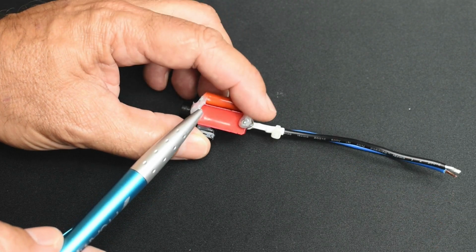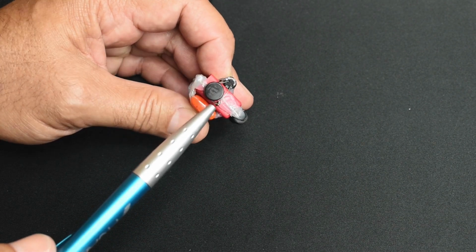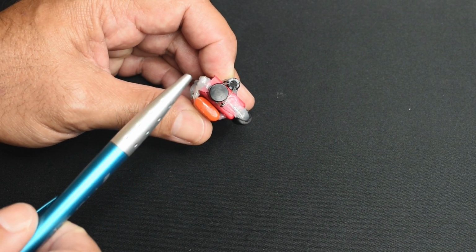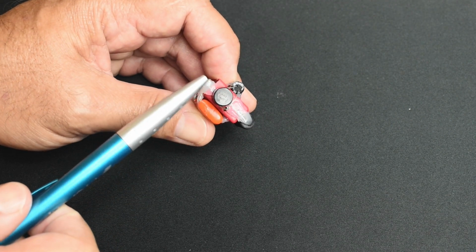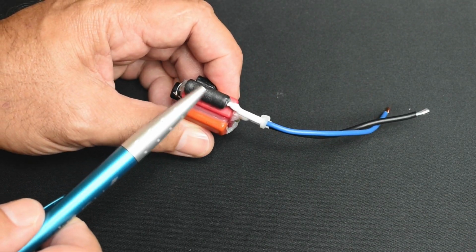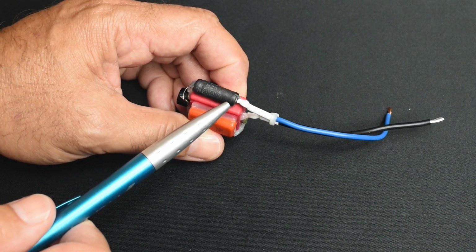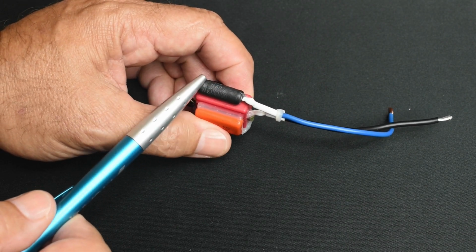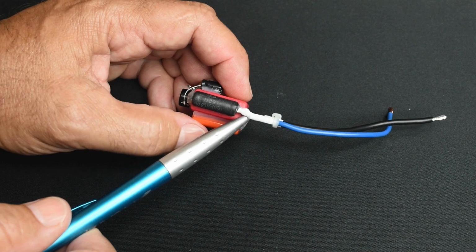The other side, right over here, ties into this component. This component is a very small 700 volt rated bridge rectifier. So you have alternating inputs, one on the left, one on the right. So from the capacitor, it goes into the alternating input on this side. And on this side, it goes to this resistor. Now, normally I would use a 1 watt, 100 ohm rating resistor. I didn't have one laying around. I only had this 3 watt, 62 ohm. The purpose of this is to limit inrush. So try and keep it around 1 or 2 watts and 100 ohms, and you should be fine.